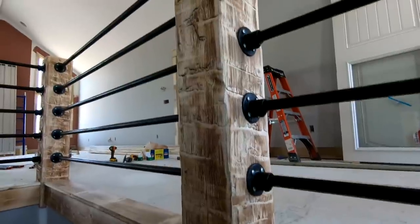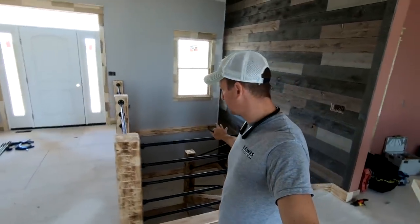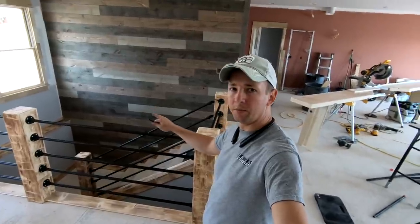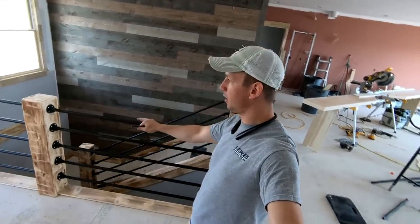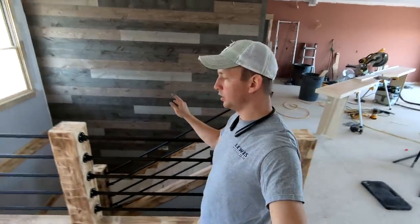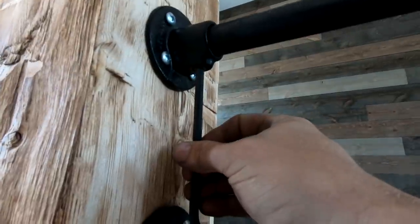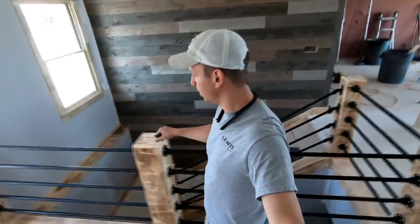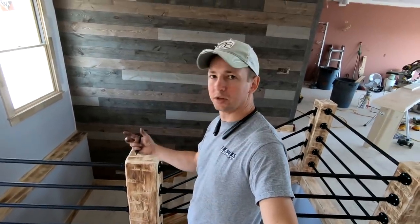As you can see, everything came together really well. I was super pleased with this project and how everything came together. The newel posts turned out well. I'm getting ready to take all of these pipes and brackets back off so that the painter can stain all of these posts — it will be a much better result than trying to stain around this stuff. I did want to mention: there is a set screw on the underside of these brackets that uses a quarter-inch hex, and that will tighten these pipes up inside the bracket. This one here is tightened down and it's nice and solid — that is how the pipes are secured in the brackets and what keeps them from wobbling.